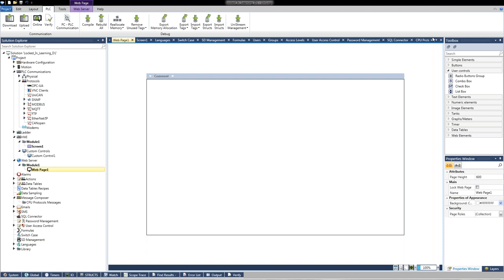And if you plug that into our Ethernet port on the UniStream, that connection has effectively made a local area network for the PLC. So any PC or smartphone that's within range of that Wi-Fi signal is going to be able to connect to that Wi-Fi signal, just like you connect to Wi-Fi at home. And once you're connected to that Wi-Fi router, you are effectively on the same network as the PLC. So you can remotely view it, connect to it, download, upload, do anything like that you need. So yes, highly advantageous to throw a little Wi-Fi router inside the cabinet if you need. They wouldn't even have to open up the cabinet door. They could connect anywhere that they're in wireless range of that Wi-Fi router.